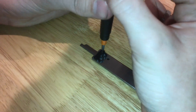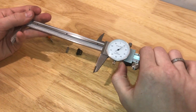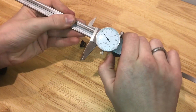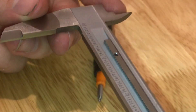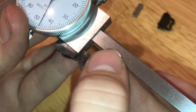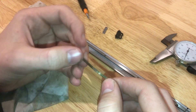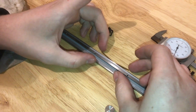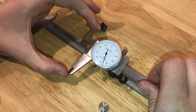I'll remove the stop on the back of it. Then the back piece comes off and the front piece falls off. Now the whole assembly should just pull straight out the back without those stops in place anymore. There's the rack up top where the pinion gear rides along. There's a little spring that goes up there — it's like a friction plate. You can see how it's worn right there. That goes in there and pushes down, keeping friction, kind of pushing it up.